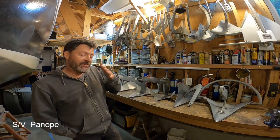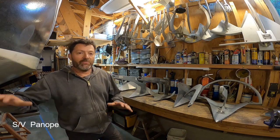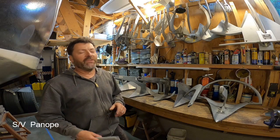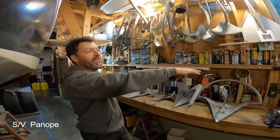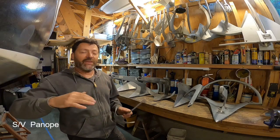And that is, how do anchors fly or glide away from the vertical line during a deployment when the boat is not in motion and there's no current — everything is just in a static situation. When I say gliding or flying, don't expect anchors to be like an airplane gliding off at some shallow angle. We're talking about an angle that's something other than dead vertical, other than 90 degrees.